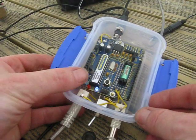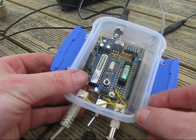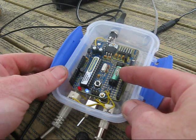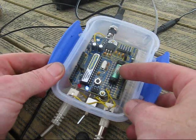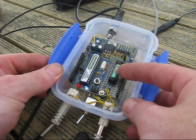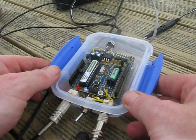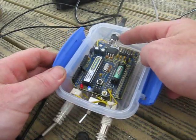I was going to use a separate board and another chip, but I had difficulties uploading the program, so I gave up. There's very little hardware you need to add. All I put on was a reed relay and a protection diode. The Arduino can just drive a reed relay. It's also fine for an optocoupler or a transistor, but it's not really satisfactory for a larger relay. The only other parts are a couple of sockets, a switch, and a power connection.